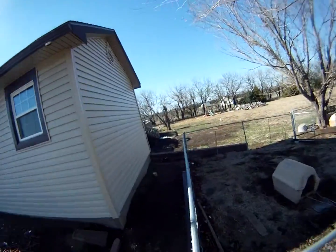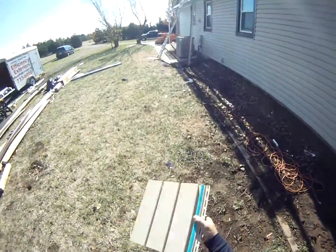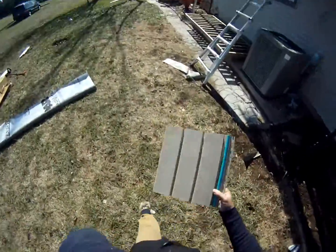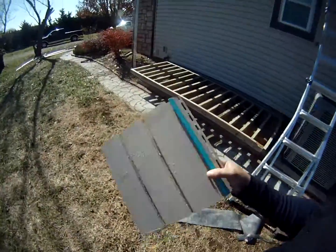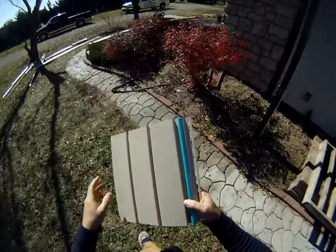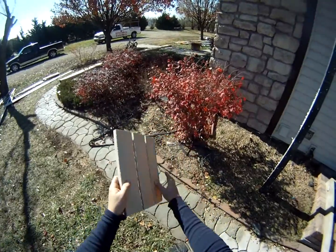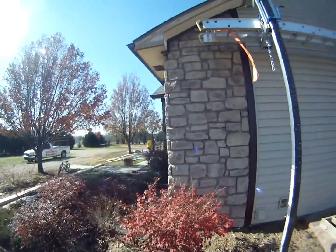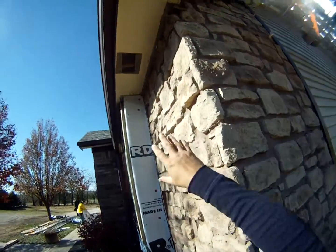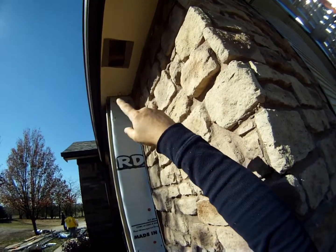With this house, we increased ventilation by adding vents so it won't get sick home syndrome. What we have here is vented soffit, as you can see on the sides where it's hidden. What we did, we added holes underneath the soffit, and then we screened it in to keep the bugs and all the unnecessaries out.